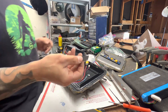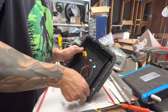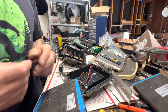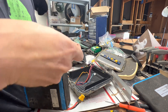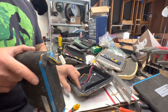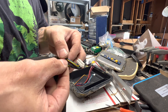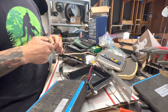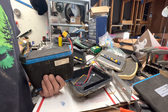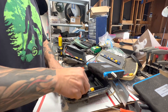Now you're going to take some foam — you have some foam sitting around from your badger job. Take that little piece and play it right down around the corner where you just Dremeled, covering all of that area that has shaved plastic on it. Alternately, you're going to take a thinner gasket or another piece of thick gasket and put at least one strip down over the balance leads. I don't want to rest my balance lead safety on one piece of foam in the battery box — if that piece fails, we have the redundant foam on the balance leads to carry us through until the next time we can get in there. I would be as redundant as I could. Put some foam on the balance leads so that when they're in there, it's not balance lead rubbing on the tray — it's foam rubbing on foam, which is a lot better for the balance leads.